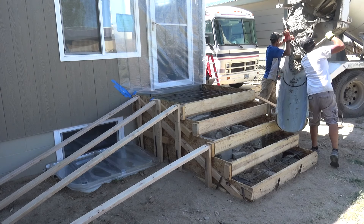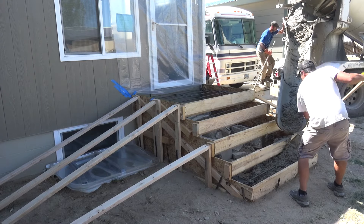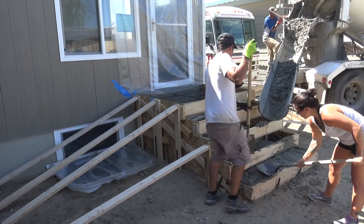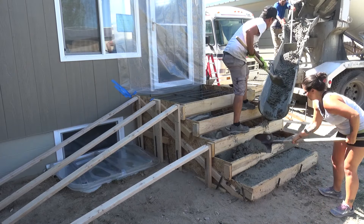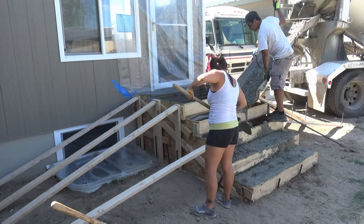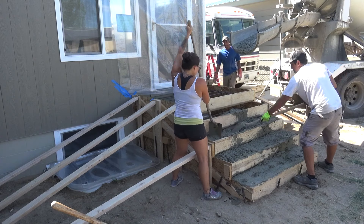Now it's time to start pouring the concrete. I've ordered around two and a half yards of ready-mixed concrete. To figure out how much concrete you need, there are various concrete calculators online. This staircase requires about three yards of concrete, but with the filler I added — about half a yard — I ended up at two and a half yards. I've started pouring from the bottom step and will work my way up one step at a time, making sure to pack the concrete thoroughly in all areas. The concrete should be at a consistency where it's wet enough to pack and fill all areas but not so wet that it starts spilling out of the bottom steps. It's very important to make sure the concrete is packing all the way to the bottom of the forms — the higher you get on the stairs the harder it becomes to pack.